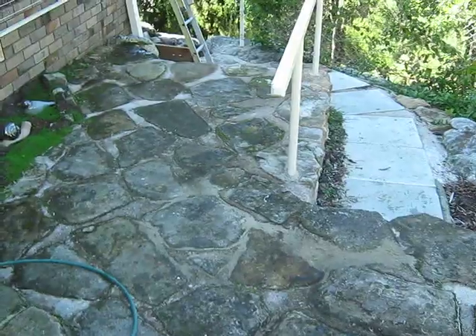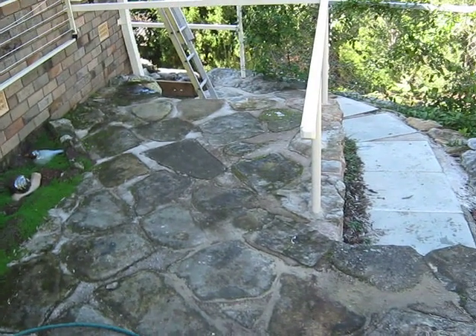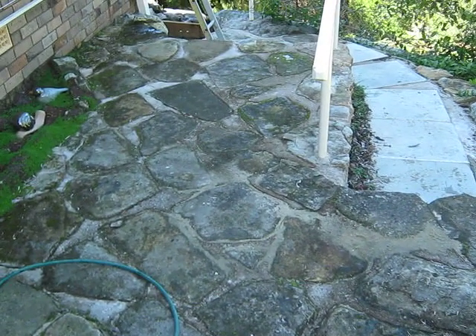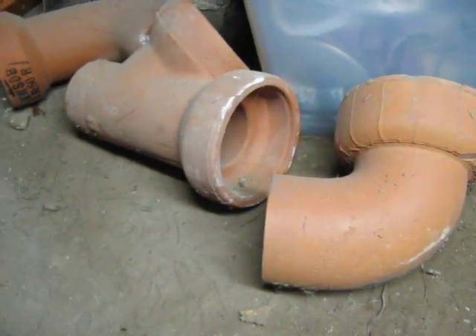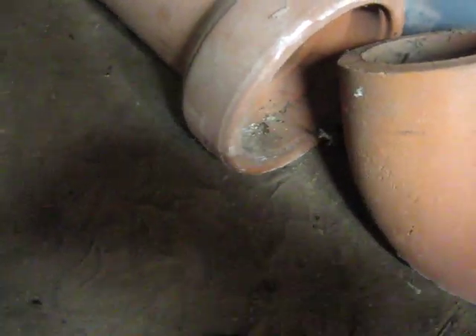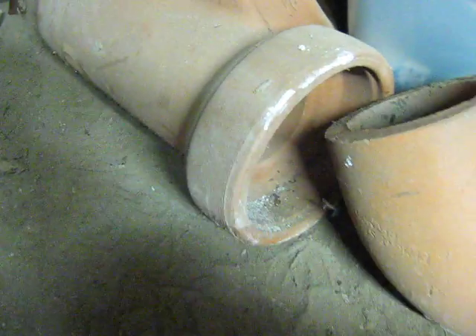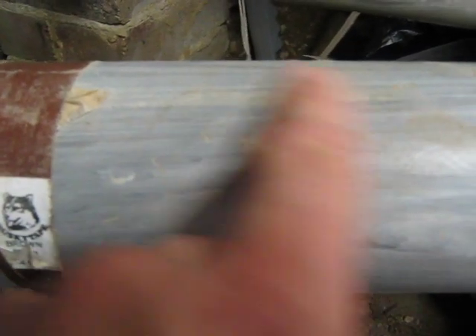One of the pipes they've used is a ceramic runoff pipe, and sometimes with ceramic pipes the roots get into the joins and actually start to grow in the pipes for water. You can see here some of the ceramic pipes they left behind as spares when they built the house — this house was built in the 1970s and these were just being phased out. The pipes are joined with cement and tree roots grow in to get the water. These become dislodged or cracked. You can also see some of the very first PVC piping, which has got streaks through it.